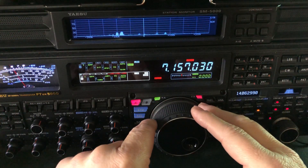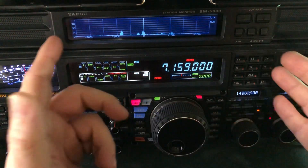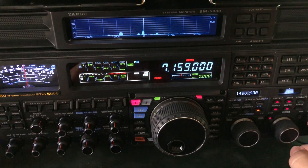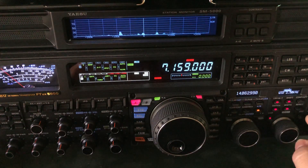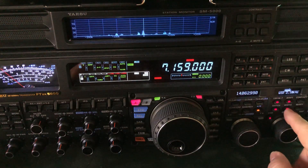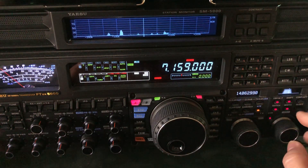Well, there's a station here, so I'll go to 159 — two kilohertz above him. So pretend I was having a QSO here and he moved in. Hear the higher metallic sound? That calls for negative shift. And the amount of shift you do — look. They work together: as I get more narrow here with the width... and remember, this is the DSP width, the computer part of the radio.